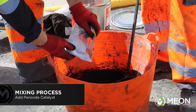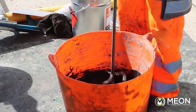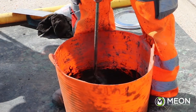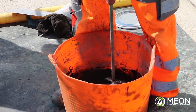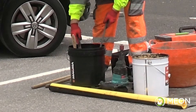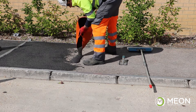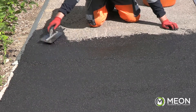Now we can add the peroxide catalyst. We recommend pouring the peroxide sachet into a small jug first so that we can evenly disperse it into the mix whilst mixing. Once this is added, it is important to continue mixing for a minimum of two minutes so that the entire mix will cure. The equipment should be cleaned immediately as this product will cure quickly. We now pour the Permafix L272 over the application area and trowel out as thin as possible, creating a smooth and consistent final surface.